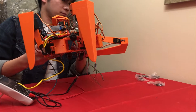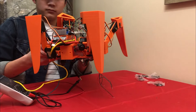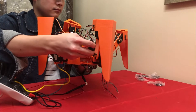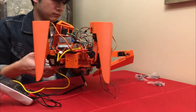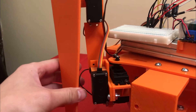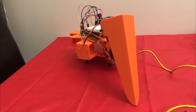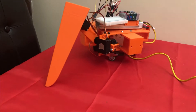Or maybe not. In theory everything looked great in simulation, so how come things fell apart in real life? For starters, I assembled some of my servos in the wrong orientation, so one particular leg just flailed about aimlessly. Another issue was that the weight of the servos was slightly bending the plastic plate at the leg's mounting point, resulting in the robot dragging its feet along the ground since it wasn't lifting them high enough. Increasing the step height in simulation and recomputing the joint angles fixed this issue.